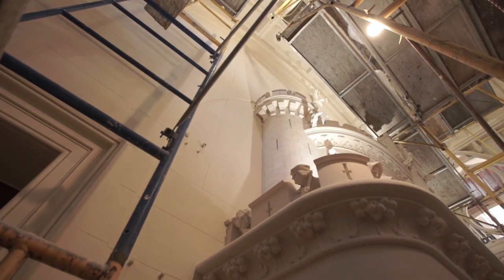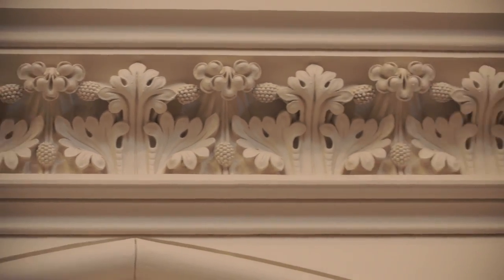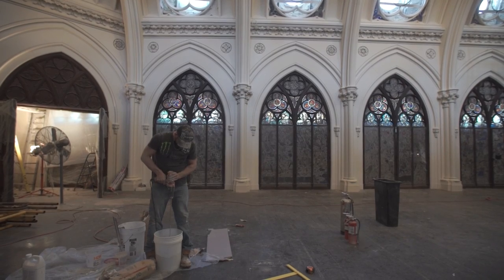They added a pigment within the molding plaster. It was actually just a bare plaster — no primer, no finish. You couldn't use water. You basically had to just vacuum what you cut off, and we were able to use different sandpapers to bring it down to a nice clean surface, and then actually repair and retool all the broken pieces throughout.